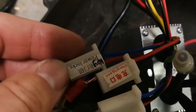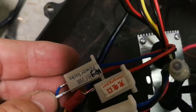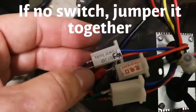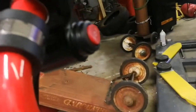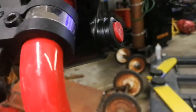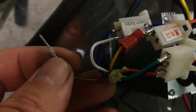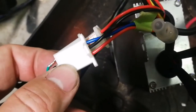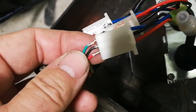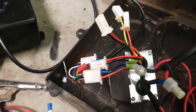This other one labeled 'power lock' — I've got 'key' written on there — is your key on/off switch. I'm going to use that as a kill switch if it runs away or something on the handlebars, because I still have that power switch there to kill the bike. I used the three-speed switch thing — whatever you want to call it — as a kill switch; it's just a switch. I've got two of the wires hooked up there; the third is for the three-position switch so I'm not using that one. Here's the throttle: blue, black, red and green — black and red to the twist grip. I'll put a link in the description for the twist grip because it was way cheaper than all the quote-unquote kits on eBay.